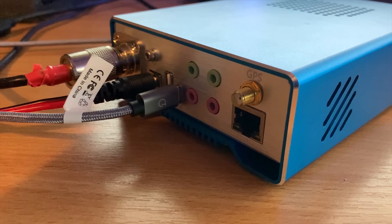The USB-C socket can be used with a supplied cable to plug into your Windows 10 computer. Once plugged in — no driver required — you will have an available COM port and a sound card input and output to the radio. This allows us to control the radio via CAT commands and also pipe the audio in and out of the HS2 from your computer. Using the COM port and the inbuilt sound card you can then easily set up third-party software to work the digital modes.